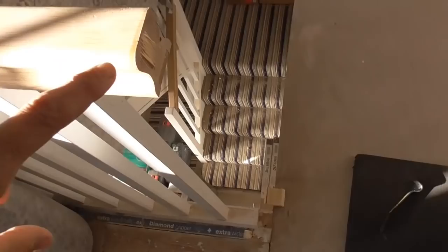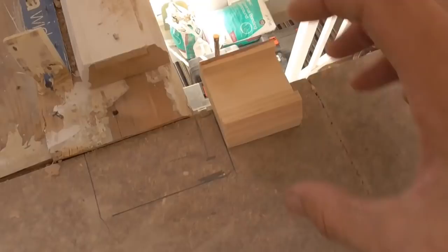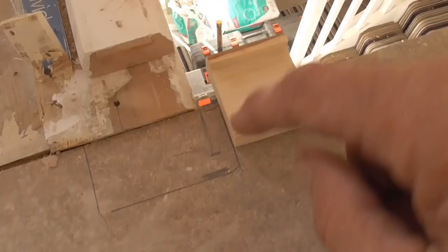So what I've done — we've got a set point we've got to work to, which is basically the end of this handrail and base rail here. I would have liked to bring this newel a bit further in but I can't because it's got to go up against this handrail and base rail. What you saw me do there is push it up to the shoulder of this base rail, draw around it, and this is an off-cut of the new base rail. I've set it in — I'm only guesstimating at the minute but it gives me an idea of how big my nosing needs to be.